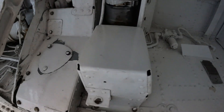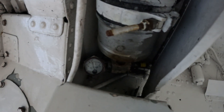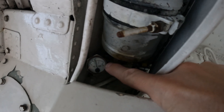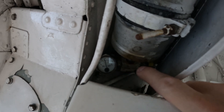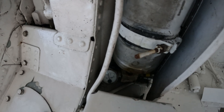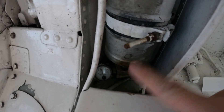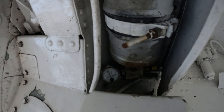We've got one more over here — that's the emergency brake accumulator. It's got a pre-charge of 1,000 PSI on it, and then we need hydraulic pressure to charge this up the rest of the way. That one should be okay, but we'll hit this with some soap water too once we charge up the air system.